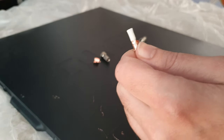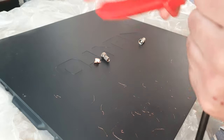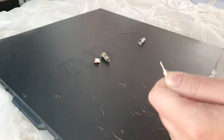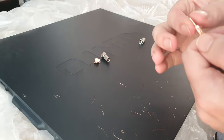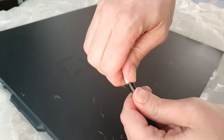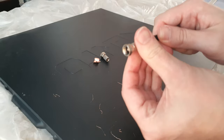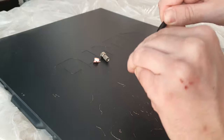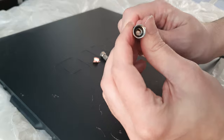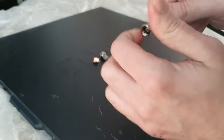I've taken off the aluminum foil, and now I'm going to take off the plastic insert. I'll get my F connector and start screwing it on — this is where it separates the men from the boys, seeing how hard you can twist it. Just keep twisting and keep an eye on the inside to make sure the center conductor is touching the walls correctly.